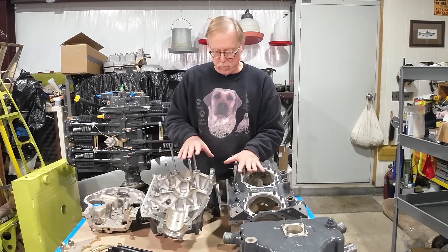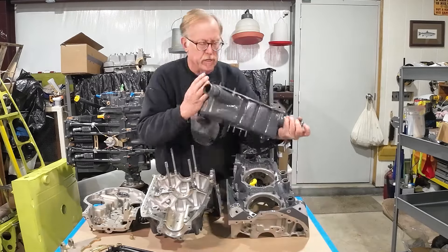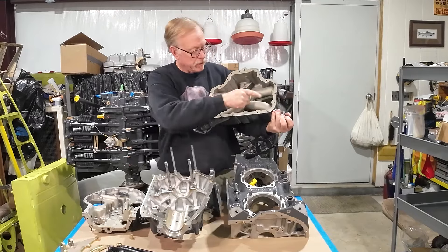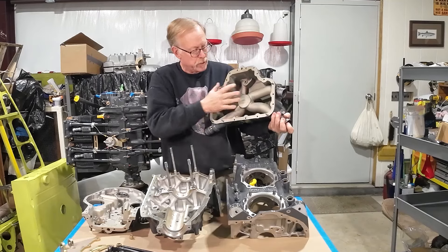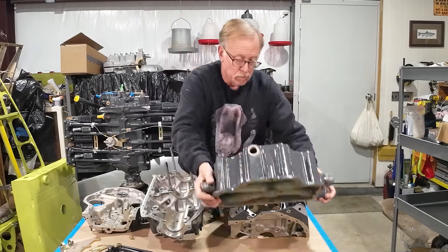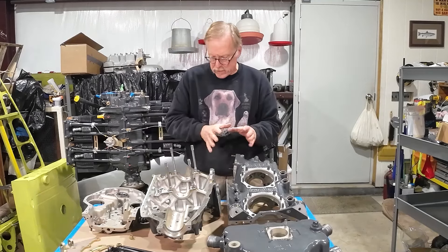This engine is very close — it looks very much like a 320. The sump is a very simple sump. If you look at the sump here, it's all cast in — the riser and all that, everything's integrated. Your induction area is heated by the oil. This is an O360-A1A, so a pretty early mark engine.